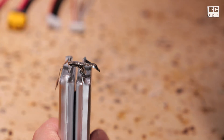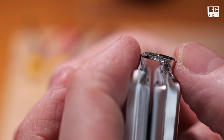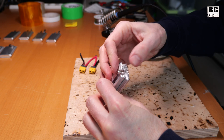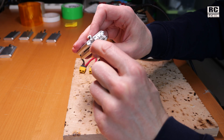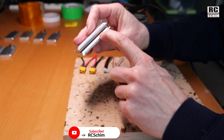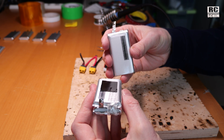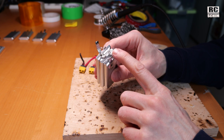To make it easier, you want to double-sided tape the pegs together and line them up well. You just have to fold them up, and if you apply heat up here it will have a very good bonding on this sandwich and it will be a solid bridge. Make sure that nothing can touch the exposed connections, and it's also held in place by the tape. For the next two cells, use the double-sided sticky tape on the bottom but not all the way to the top, to have some space. Just make sure that minus doesn't come to minus, which is easy to check with the barcode.